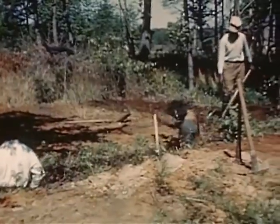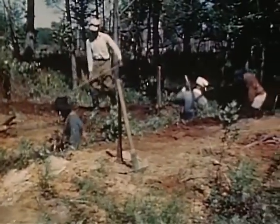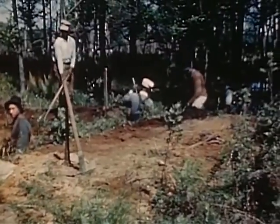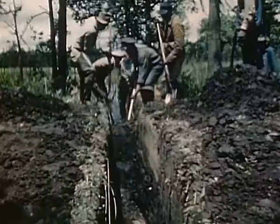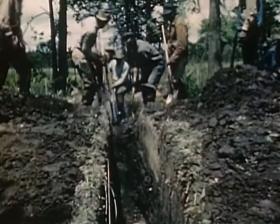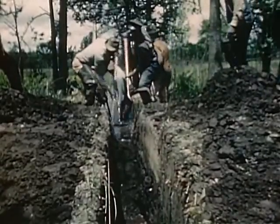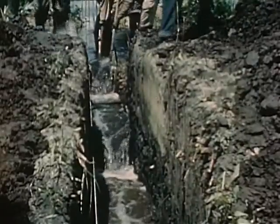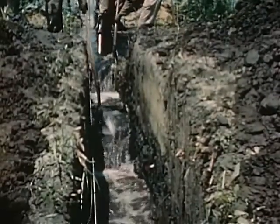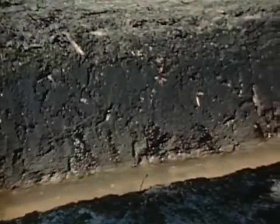Excavated material was spread evenly along the banks so that water could not collect behind it, and to keep the spoil from washing back into the ditch. The main ditch was put into service by making an entrance cut or tapping the pond. Good engineering and proper construction paid off as the water moved smoothly and rapidly out of the swamp.